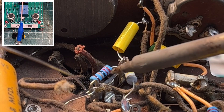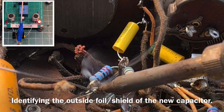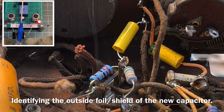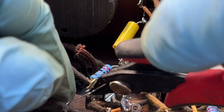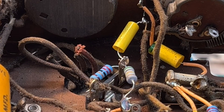I'll be using this connection point for my B-minus side of the power supply, so just enough to hold it in place for now. I'll come back and clean that up whenever I place the electrolytics in. So a neater method and procedure versus what I found with the two resistors just high in the air with the capacitor floating.